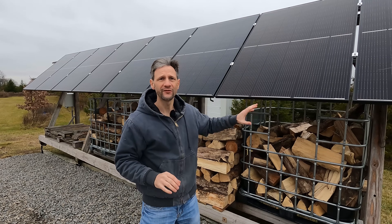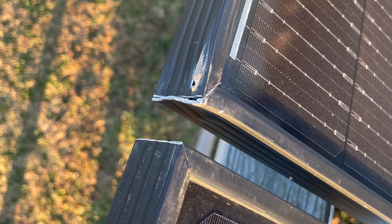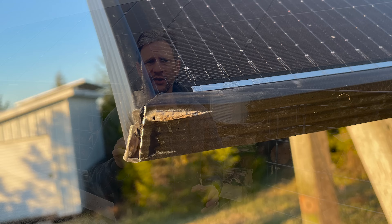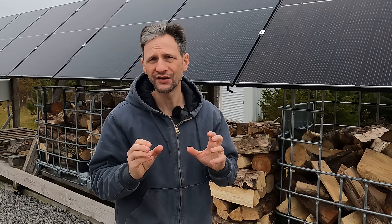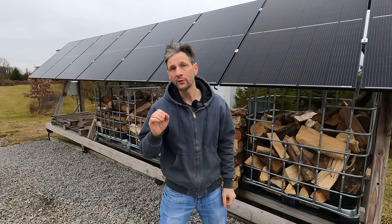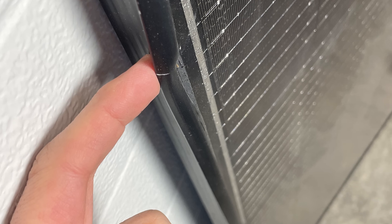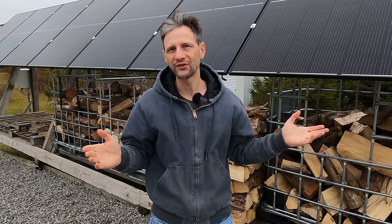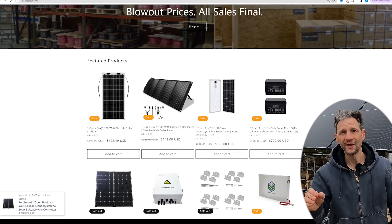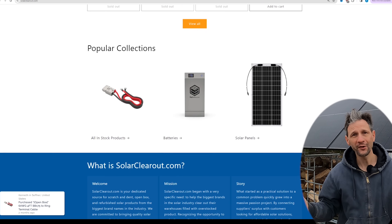Now that all the panels are installed, I've had a chance to evaluate the damage a little bit closer. Most of the panels just had a scratch on the glass or a dent in the aluminum frame, which is not an issue at all. A couple of panels had been hit in the corner hard enough that the glass was coming through the aluminum — I'm amazed the glass didn't break. It would probably be a good idea to add a little silicone over that spot to make sure no moisture can penetrate. I ordered one extra panel, which I always do now to prevent problems for future Dave — good thing I did. One panel had the frame hit hard enough to pull the aluminum away from the glass; I saved it for a future repair project. Thanks to Solar Clearout for supporting this build — check out their website using my affiliate link in the description.